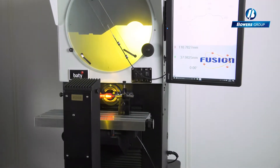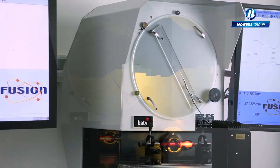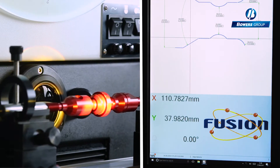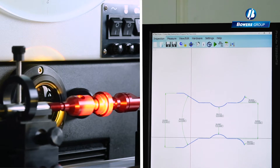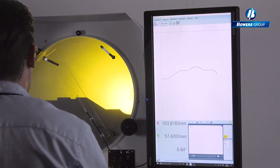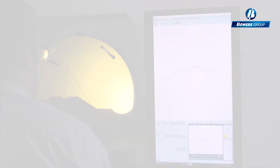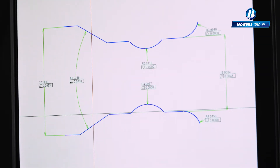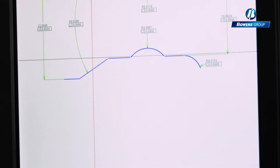The FT2E digital readout for the BEITI projectors is displayed on a large 22-inch touchscreen monitor, displaying the measured part. This highly intuitive and easy-to-use software allows the user to draw dimensions, including geometric tolerancing and true position. It then positions them in the part view to replicate the manufacturing drawing being used for control. The dimensioned part is displayed in a large drawing area and can be viewed with panning and zooming using standard pinch-and-drag touchscreen gestures.